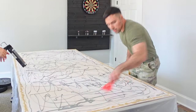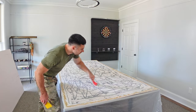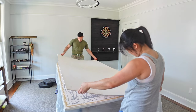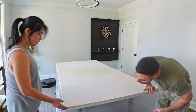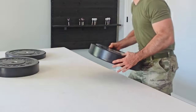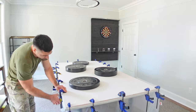Since the boards are already painted, wood glue is not going to work very well, so I chose to use liquid nails instead. The main problem with liquid nails is it doesn't spread very well unlike wood glue, so my goal was to get as much liquid nails onto the surface as quickly as possible. While I handled the outer edge, my wife doused the rest of the board, then I spread it around using a plastic putty knife. Once there was enough coverage we put the top board on, lined up the edges, added weights and clamps on the outer edges, and left it for 24 hours.